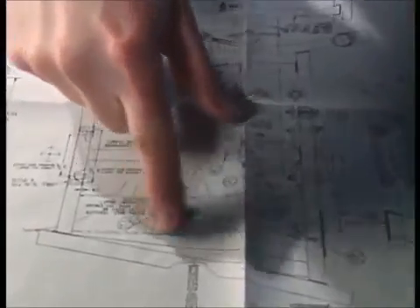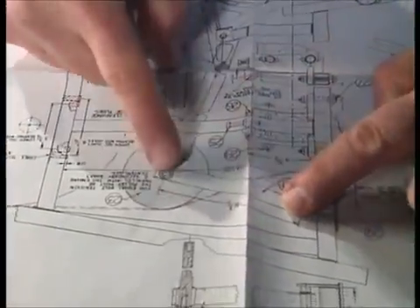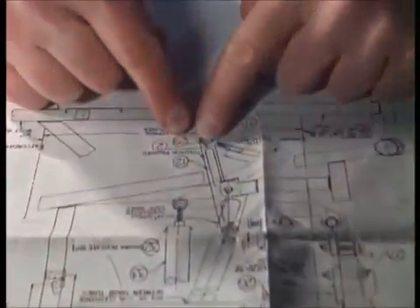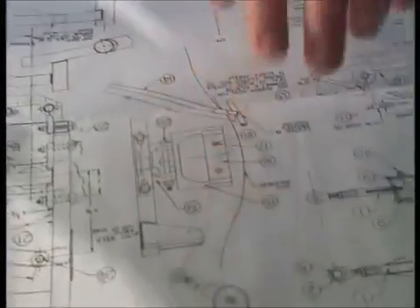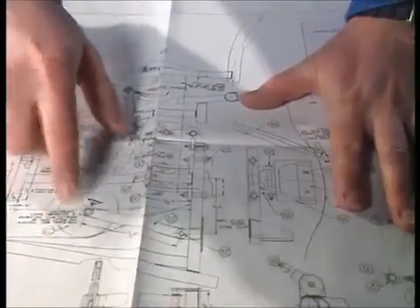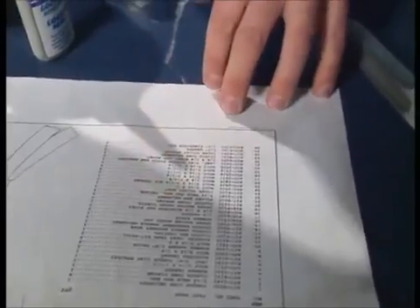This is a very complex looking drawing, but if you get rid of all the superficial stuff you don't need to know about and concentrate on the middle, you can see there's the top of the pulley looking down on it. This is the main frame it sits in, that's the arm that goes to its hinge point there, and then we've got this connector here, a bracket there, and this that continues here is actually the lever that goes into the cockpit. The first job is to properly attach the pulley to this arm here, which is number 21 — the pulley arm weldment, E279010.